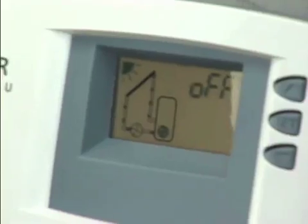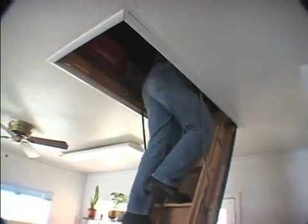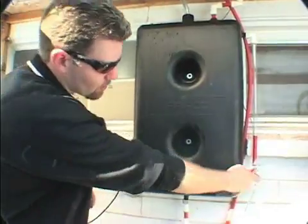When the system turns off at night, or if your water heater has reached maximum temperature, all the water that's on your roof circulating through the solar collectors and in your attic drains back into a little tank that's right next to your water heater.